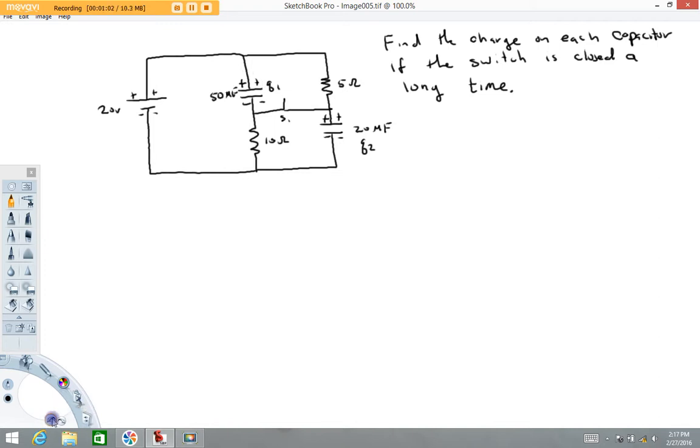So this problem only has one current. And that current would be through this branch. Right? Same reason, we're not going to have a current over here because once this thing is totally charged, the current in this branch will go to zero. So the green represents a region where we are going to have a current. I'm going to go ahead and draw that current, I.